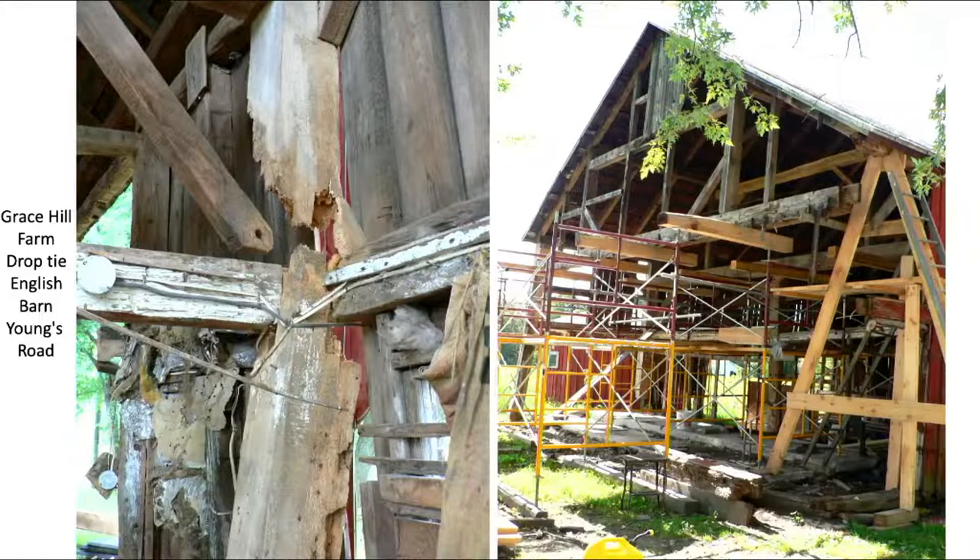This is a perfect example of a timber frame that is pretty tired. This is my brother-in-law's barn that I restored for him, probably 15 years ago. This building was approximately two feet out of plumb — one end of the building, the foundation had collapsed and it was two feet low. I was able to jack the building up and get it back to within one inch of level. The building came back to within four inches of plumb just by raising the floor. Over to the right, you can see how I used scaffold to hold the tie beam up — there's no post here, no post here, no post here. That was completely gone and rotted out. So I had to replace the end post and the interior post. All the upper members were decent.